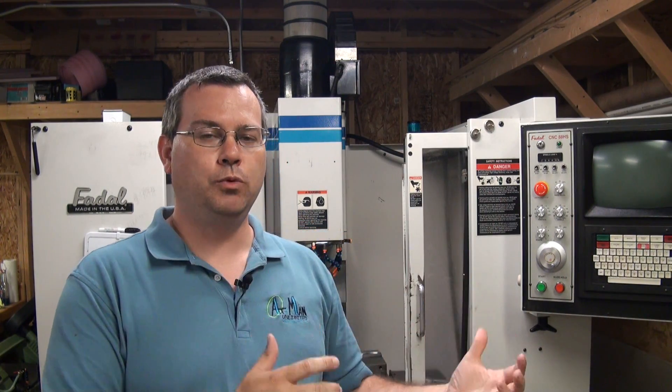We got our new boards swapped in. The main firmware version is the exact same as I was previously running, so no changes there. However, the firmware on the new servo control cards is many revisions newer, and I'm noticing some important differences — mainly the backlash comp appears to be implemented and works a lot better in this newer firmware. I'm going to try to arrange another ball bar video to see if the new cards affect the ball bar at all. I'm also going to re-tune and re-balance the servo drives, and make a video on how to balance drives on these machines — they all use analog commands, so balancing is important.